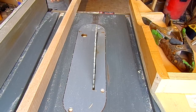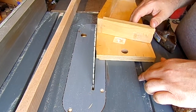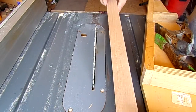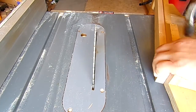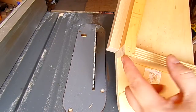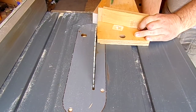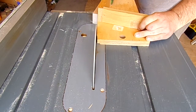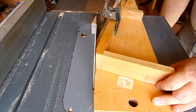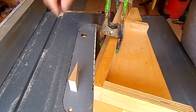The first thing I'll do is use the scarf cutting jig, which basically rides in the track of the table saw and holds the piece of wood at the angle you need. I take a piece I'm going to use for a neck — that's one by two — and clamp it into the jig. Once it's clamped in, you can see the saw is going to come through at an angle. Once I put it down in the saw track it's ready to go. We'll turn the saw on — it'll be noisy for a second. We've basically cut a little chunk off the end of the neck at that 17 degree angle.